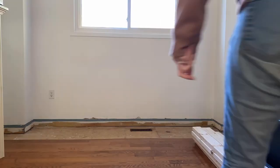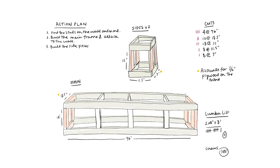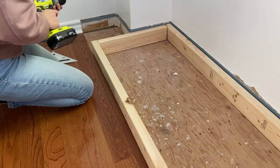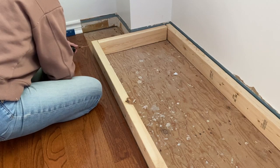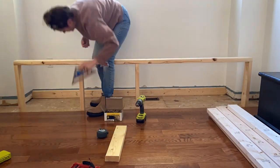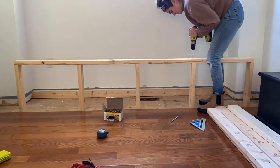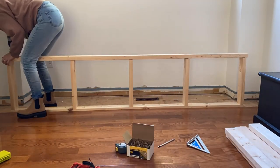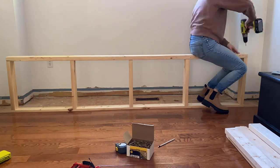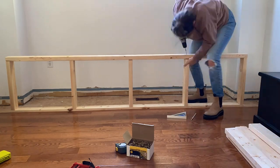Once the floor was removed I could accurately plan out how I would build the frame. I referenced a tutorial from HGTV, which I'll link in the description, but I had to customize it extensively to fit the space. I framed the main portion of the bench that sat between the columns first, then filled in the two areas on either side as separate boxes. I decided to make my bench a few extra inches deeper than what is recommended for comfortable seating because it sits under the window — I didn't want whoever was sitting on it to have the window covering touch the back of their head, and I also wanted to add throw cushions for back support.